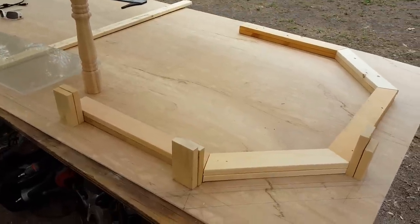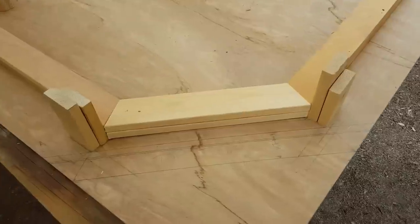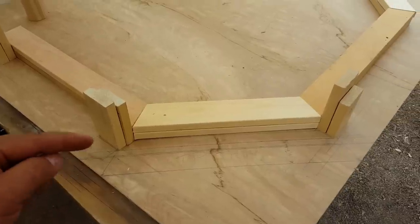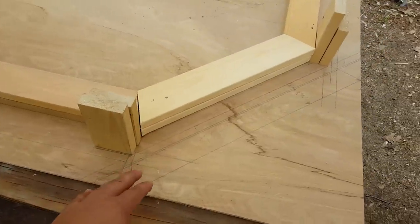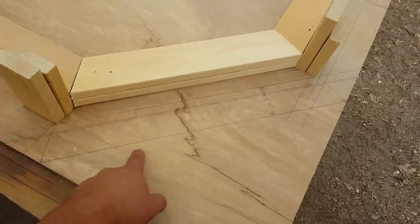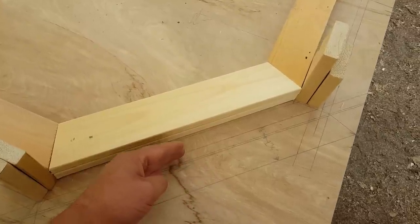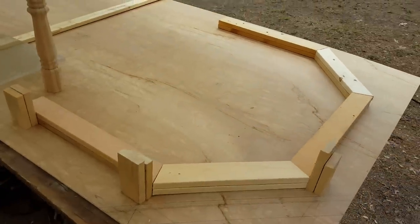I started working on the ticket booth, and you can see I have it kind of drawn all out. What happened was because I got ahead of myself on the ceiling — I actually got all the trim and stuff done on the ceiling, and that determined the size the booth was going to end up being. Since I'm putting decorative trim and crown molding, I had to make my outer line the biggest the ticket booth can possibly be, and then think through the steps with the trim going inward to determine what size the frame would need to be.